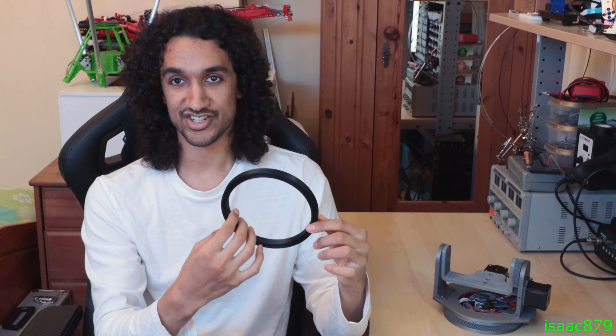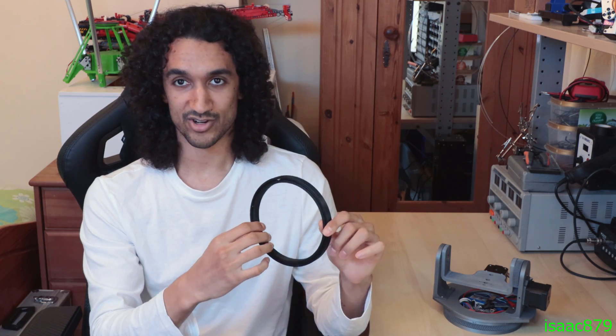This is my pan tilt mount I designed and 3D printed with my Canon EOS 250D DSLR camera. One of the main reasons I made it was to use this large bearing I've had lying around for ages. The other reasons were to do cool motion control shots and panning time lapses. The bearing cost several hundred pounds to buy, which is a bit of a barrier for entry, so I designed a 3D printable drop-in replacement that just uses 6mm BBs.